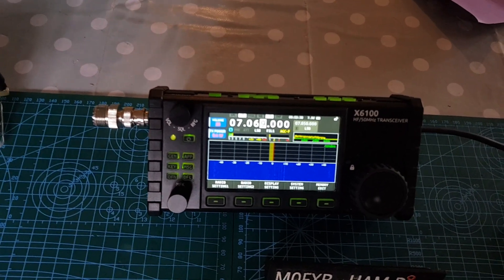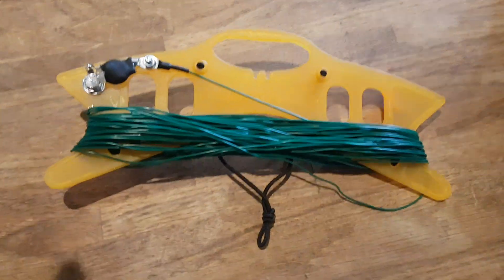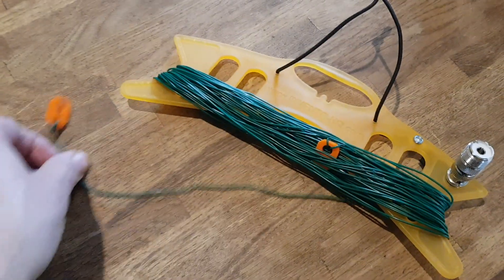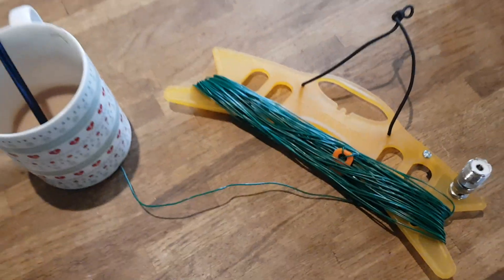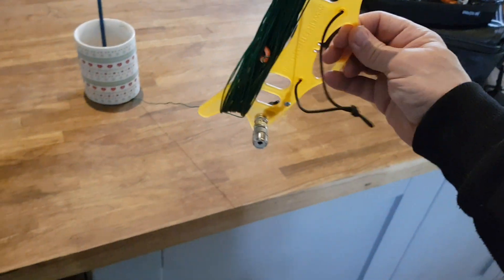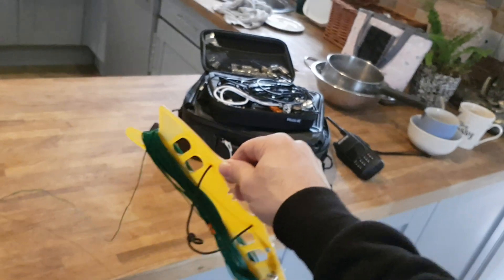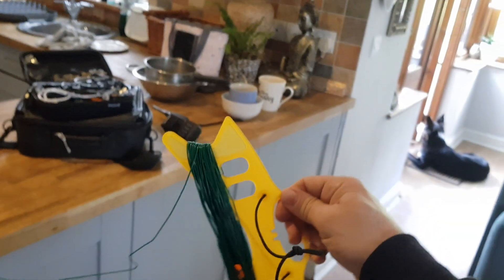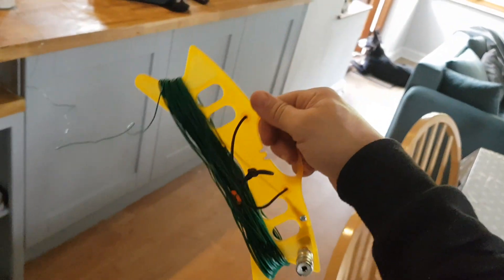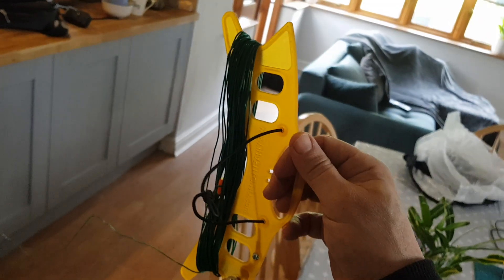So we'll start off by unwinding the 49 to 1 antenna. You just pull back this tab like so and that reveals the wire, and then we're literally going to connect the wire somewhere in the house. I'll put it under that mug for now, and then as you walk backwards it naturally unwinds. We're going to go somewhere 60 foot away from my radios here.